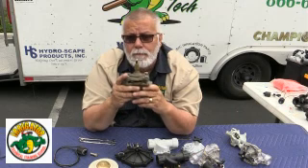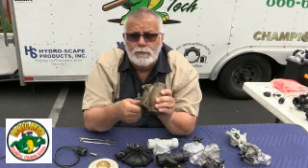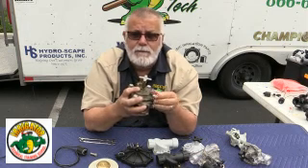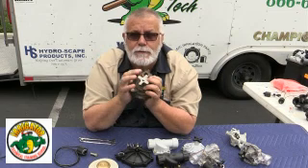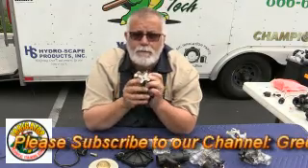I've known Weathermatic for a long time. Their brass valves and plastic valves are very good — it's a high commercial valve. You will not see it in a consumer retail store, but you will see it at all your commercial distributors stocking Weathermatic. It is a very good valve. If you have it in the field, purchase the solenoids, purchase the diaphragms, replace them, and get another 30 to 40 years of use out of it. Thank you very much, and we'll be talking more about valves in another video.